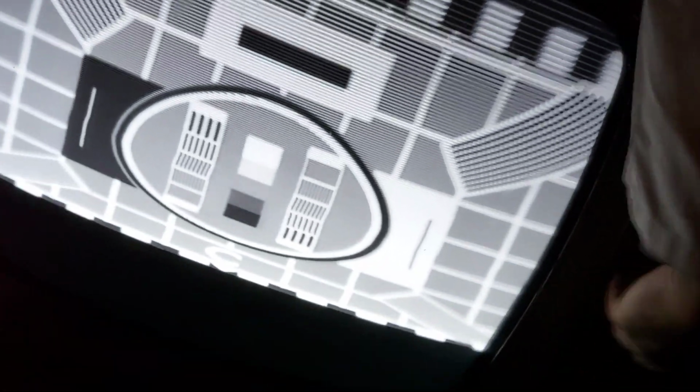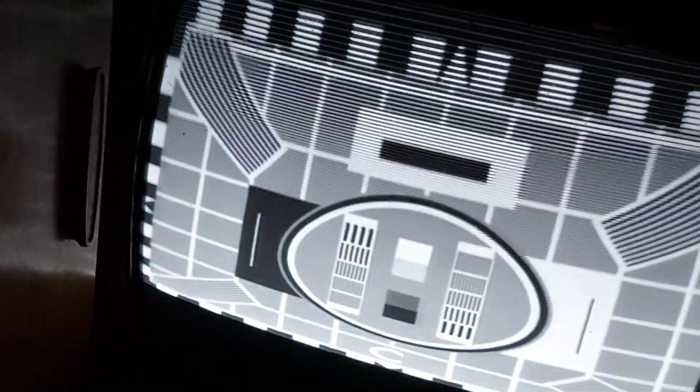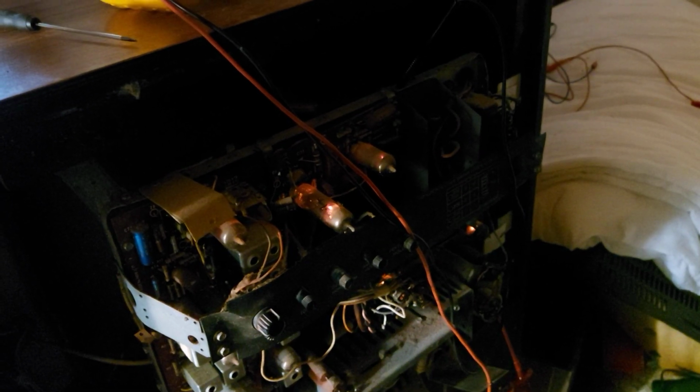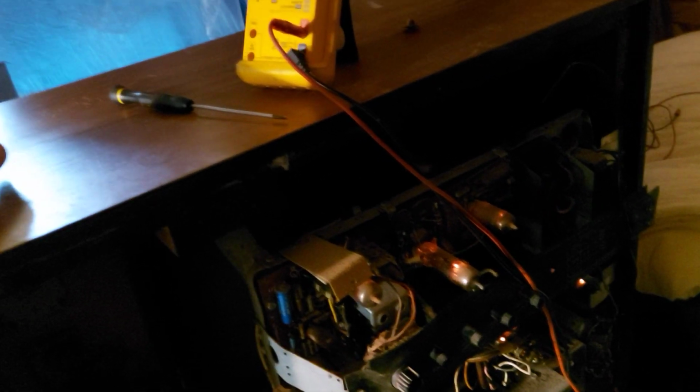It's overloading a bit, but there's certainly enough life left in that tube to give a very watchable picture indeed. And of course, with a bit of use it'll wake up a bit. Now the crack was, I'll just turn that down. I set the main dropper for its highest setting, and I was feeding this set 230 AC. So I wound it up another little bit to 250, and then the test card came in.